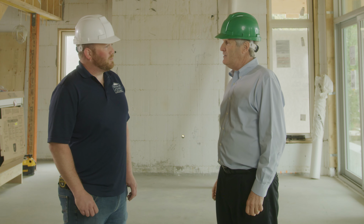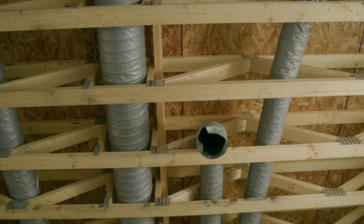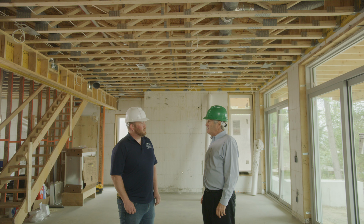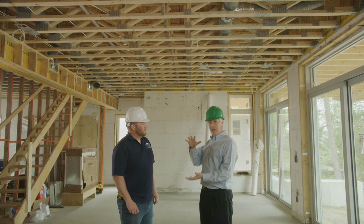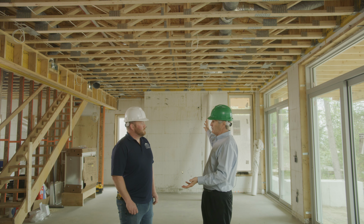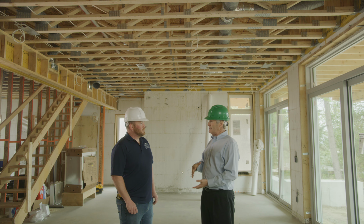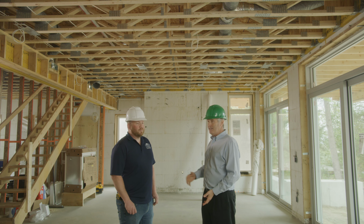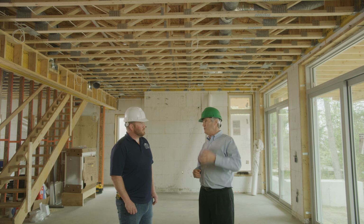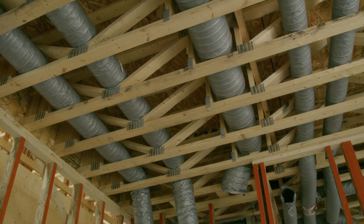It opens up a lot of options to run the ductwork. As you can see up here, we're able to run 8-inch and 6-inch ductwork right inside the floor joist. Yeah, which is kind of cool. And on our project here, my brothers and I just like that big open concept, big open ceilings. So even though we've got 10-foot ceilings, they still want all of that 10. And in this case we used the flexible duct. This is by Thermaflex, and I'm a big fan of this concept.